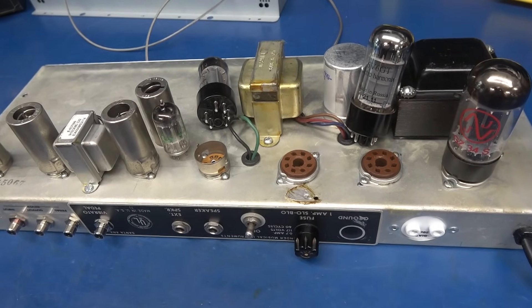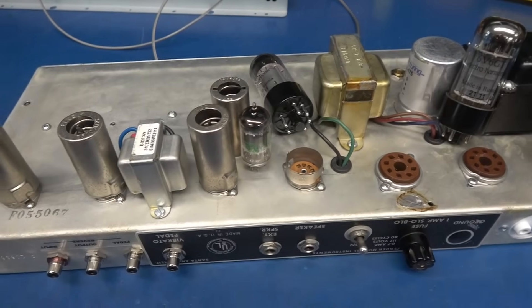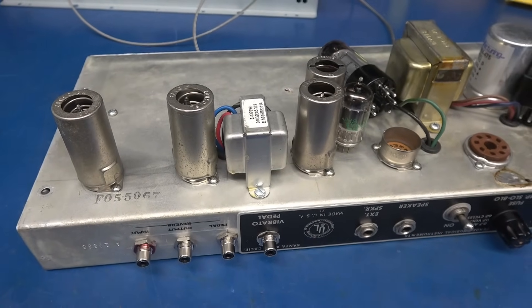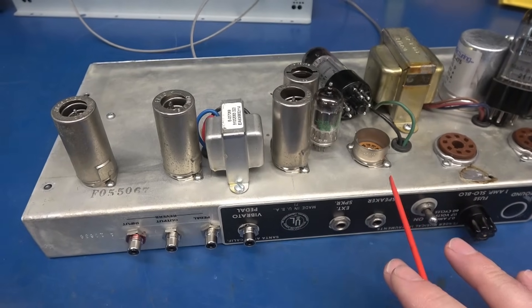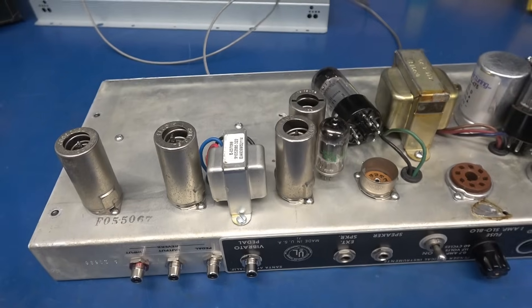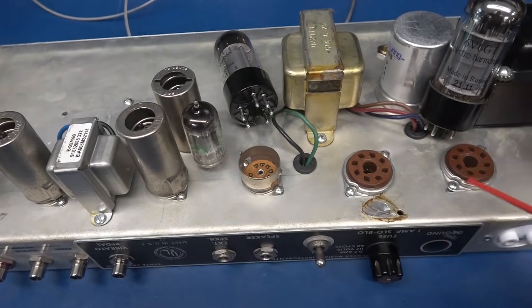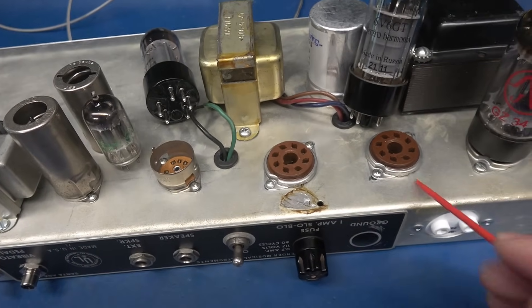The modification of the Silver Face Fender Princeton to a Fender Princeton Reverb is complete. I'm going to take you from top to bottom and show you everything I did to make this project a success. The first step was to lay out the chassis for the two tubes and reverb transformer required — luckily I had another chassis to steal those measurements from. The amp came without tube sockets, so I installed 1960s Cinch brown Bakelite types.